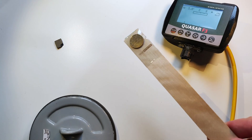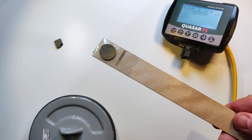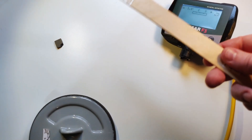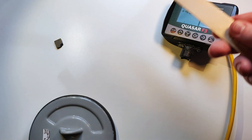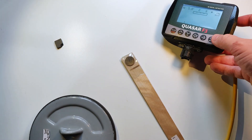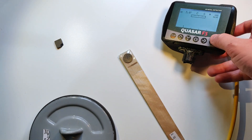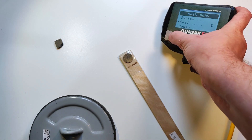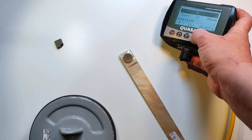Another test will be with a coin, and it will be like this: the unit should produce one sound for the coin — one definite, clear sound. Sometimes the automatic ferrite calibration makes it a little bit wrong. And I will show you an example — sometimes the ferrite zero will not give you 43 degrees.